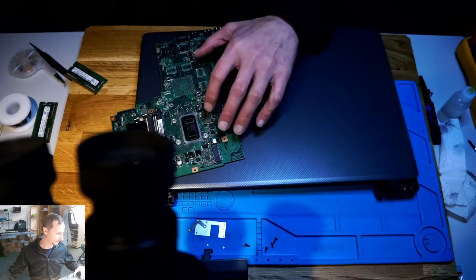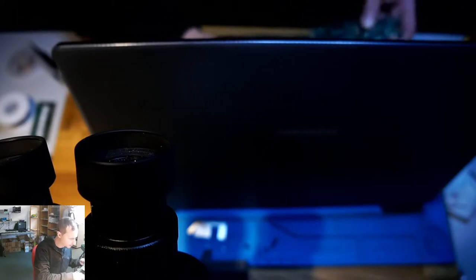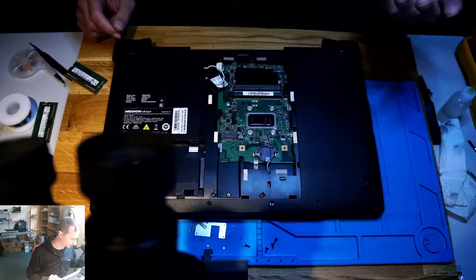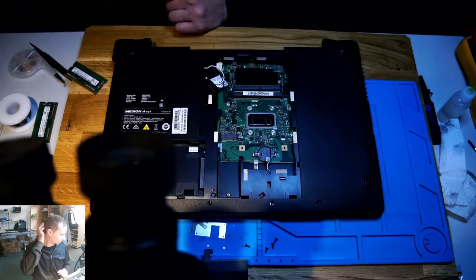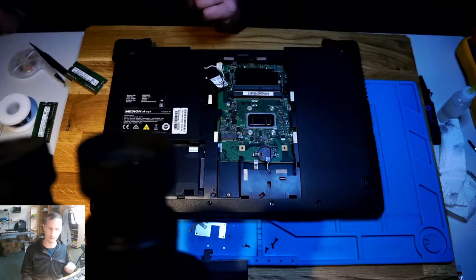Well, as I said, in this case, if you open up the backside, let me show you that. Put it back in as it belongs. Something like this here. No, completely wrong. Here we go. So here we have the cooling fan. These two caps you could measure in diode mode, so there's no need to take this whole thing apart.